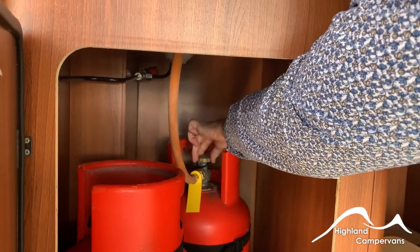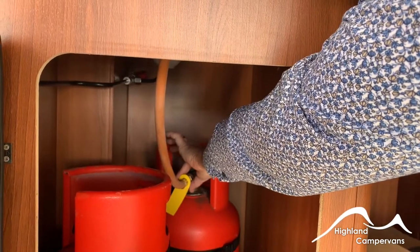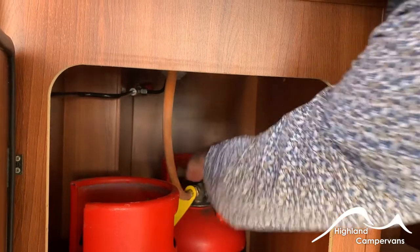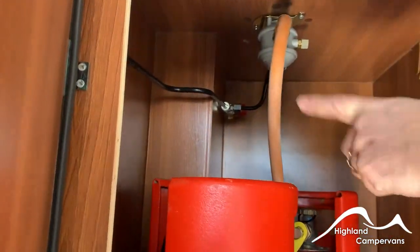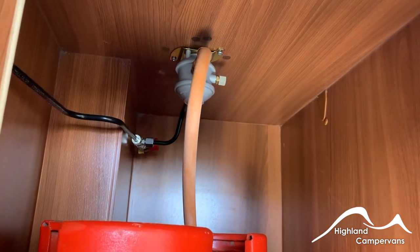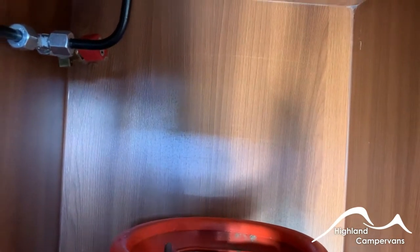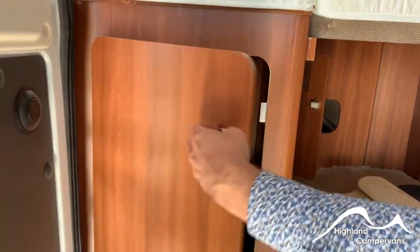You turn on and turn off the gas on the brass nut on top. You undo using a spanner and it's left hand thread — so you do up to undo, you undo to do up — to release the cylinder and change over to the other one. That's then fed into a copper core system. There is a single tap in here which is the isolator valve specifically for the water heating and room heating system. It's in the on position at the moment, and it's unlikely if you're turning off and on at the bottle that you would need to turn that one off as well.